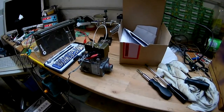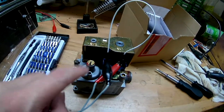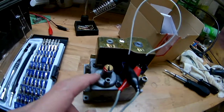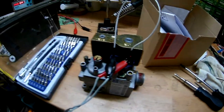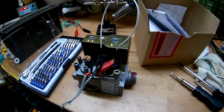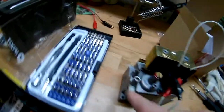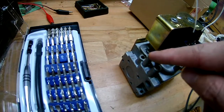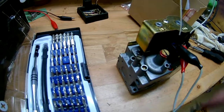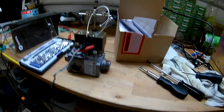The only thing you can actually change is the pressure adjustment, which is fixed with the color sealant stuff. These others I don't know what they're actually doing but they're closed — they have been closed. Maybe that's for testing something. Maybe this one is to open the vent, and then you can put a hose on there and measure the pressure or flow so you don't have to constantly restart the central heating. But yeah, this one is adjusted already.